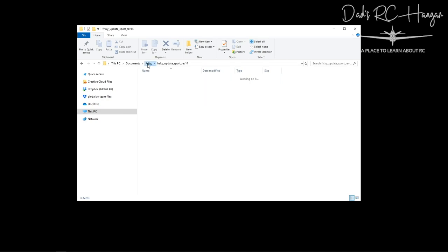Okay, we go back, and the firmware, which I put in here, is S6R, so S something R, and it has got, see, the 6 and the 8R in here. Now, if you go in here, you'll see what I'm on about. So the S8R LBT is the European version. If you're in Europe, you need to use this to flash your firmware. If you're not in Europe, you need the FCC. Simple as that, really. It's as hard as it gets.